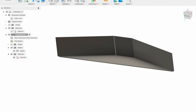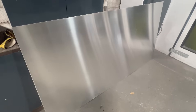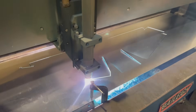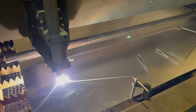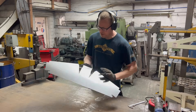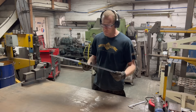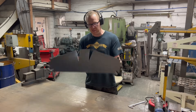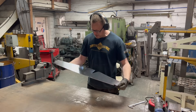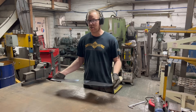Back onto Fusion 360 — I'm really getting the hang of this software now, it's proving to be super capable. I've picked up some more aluminium sheet as we ran out, so now I can plasma cut the intake ducting and get it folded up. Check that out — I'm pretty happy with that. That's very thin for my plasma cutter, that's 1.5mm aluminium. I don't have an auto-height sensing gizmo on my plasma cutter — it's an entry level machine — so when you're cutting really thin stuff, when it warps under the heat it can sometimes mess up and you won't get a clean part out.